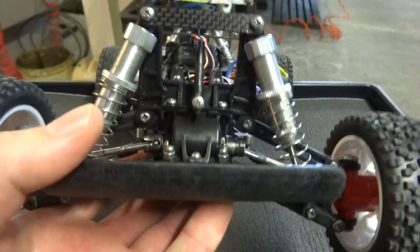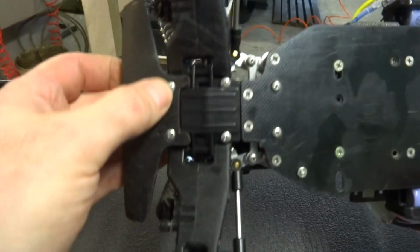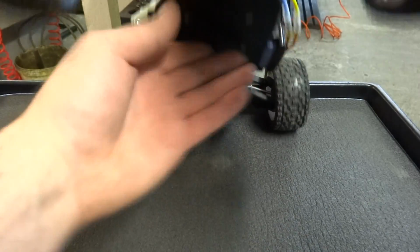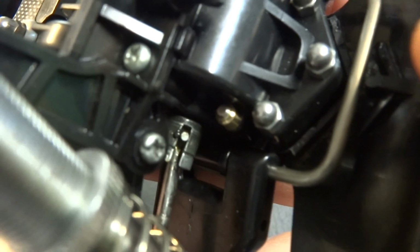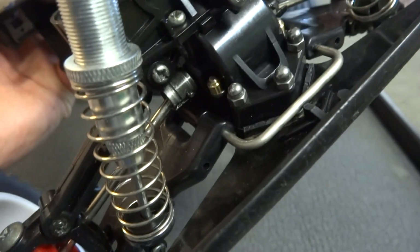In the front, the same thing. Sorry, it's a little bit uncomfortable. I go all the way through also with the bumper here, and this was the trickiest section, to go with the front gearbox cover. It's not hard to make a hole through, but there is not enough space for a nut, so I made these special brass nuts, not hexagonal but only round, so you need to hold that with your finger until it starts to tighten, to make this thing also stronger.